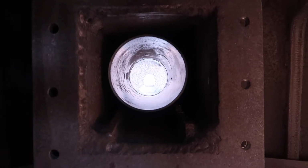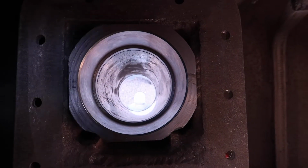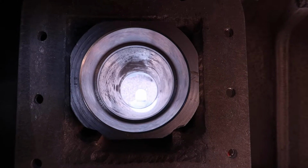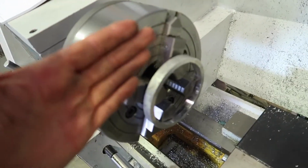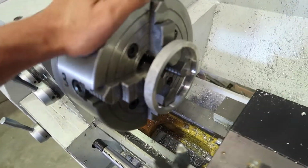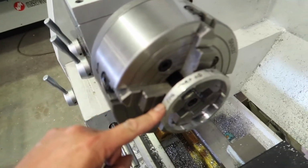Alright, so the bottom bearing and shaft is in. Now we're going to put this in. Alright, that's it. That's dry fitted pretty much. Just muck around with it a little bit more, check the angles, and go from there. We're just going to take 5mm off there to make it so that there's more space on the rudder, and 5mm shaven off so that the total OD is 110.